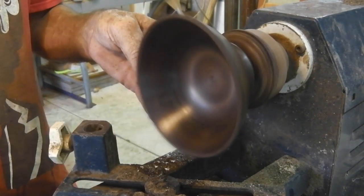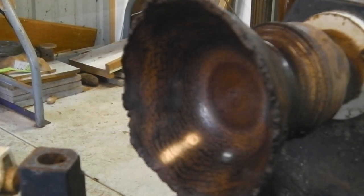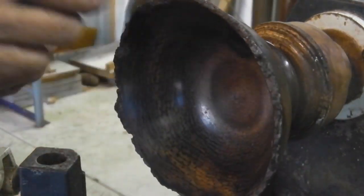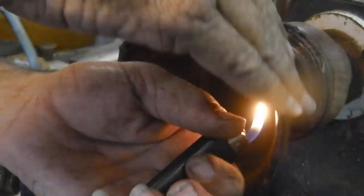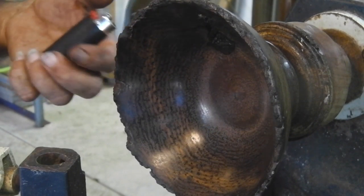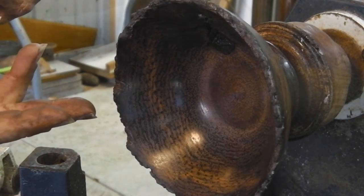Thanks for watching this, and that was my fingers luckily. And yes, it has got a natural edge on this bowl too. You may actually wonder what I'm doing with this lighter. Well, we know I've been using wax and oil, and of course bits get stuck up in things, don't they? So I get my lighter and slightly melt them out a little bit on either side, and then when I finish, I get a nice soft brush to help me get the excess wax out. So that's what I'm trying to do with the lighter and a brush, to get rid of that excess wax. So now I've basically finished the bowl.